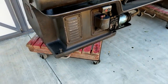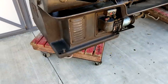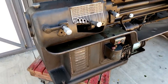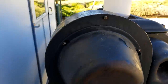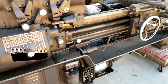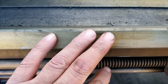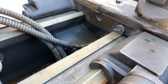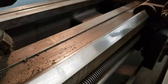This thing's kind of a beast - the riggers just left and dropped it on my big pallet dollies. I've had 10,000 pounds on those two dollies, so I can still move this thing around. Each pallet has a steel frame and six Albion caster wheels under it, so we can get this thing out of the weather when needed. Two people can actually roll this around pretty easily. I've already had to move it once. I sprayed it down with cosmoline about an hour ago, and I've locked the carriage - I don't want the cosmoline getting under there, so I oiled under there first.